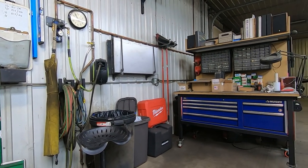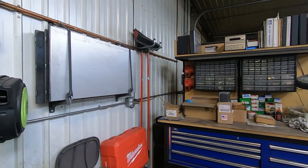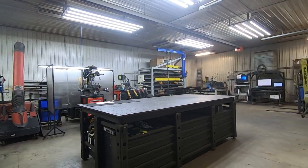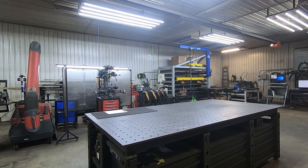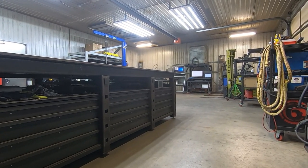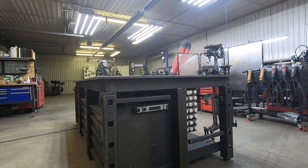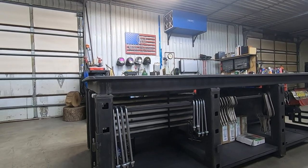Sweeping around, this is where I keep my garbage and there's a little workbench for hardware and supplies. Here are some extensions stored on a wall rack that work together with my welding table. Here is my five-by-ten welding table — it's got a three-quarter-inch plate with five-eighths holes spaced three inches on center for all the fixturing. On this side there is drawer storage below to hold all my fixtures, supplies, and clamps. On the side are power strips and TIG rod storage.